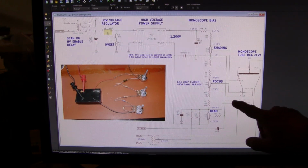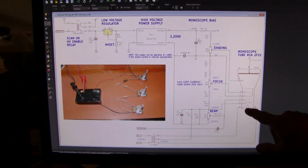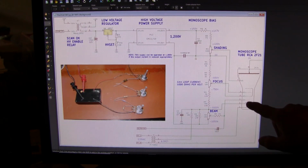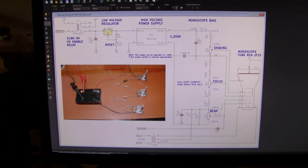The electron beam is controlled in its intensity by grid 1, which is another electrode placed just before the cathode, and it has a pinhole where the beam originates. If we make this electrode more negative than the cathode by about 50 or 100 volts, we can cut off the electron beam or set it to the level that gives us the desired output level that we'd like to see.